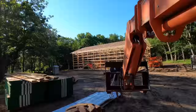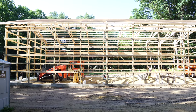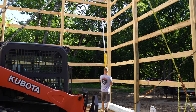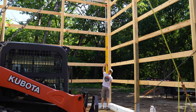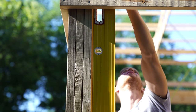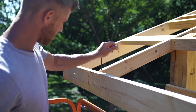The time has finally come — we're going to start installing this roof sheathing. We've got a lot of 5/8 roof sheathing for me and Greg to get up on the roof, and thankfully we've got the telehandler. Greg just finished making sure all four corners of the building were plumb and everything was ready to go. Now we're going to go up there and get a string line on our first eave wall so we can make sure it's perfectly straight. As long as our corners are plumb and our wall is straight, we can check for square and then start installing the roof sheathing.